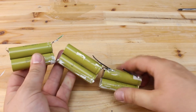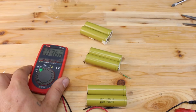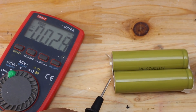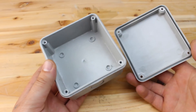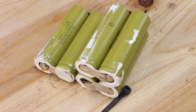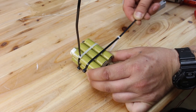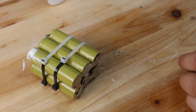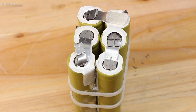Now back to the project. After removing the batteries from the case, cut off all wires and check them with a voltmeter to find which are good and which are dead. My laptop battery was in good condition, so I got six lithium-ion batteries, each with 2000mAh capacity. All six together make 12000mAh portable power at 3.7 volts, with all batteries connected in parallel.